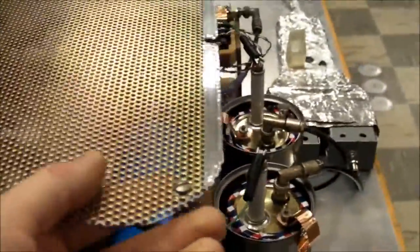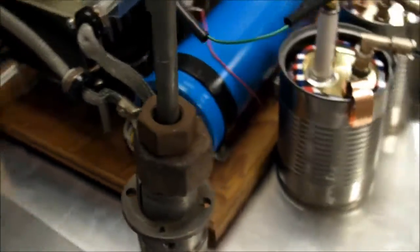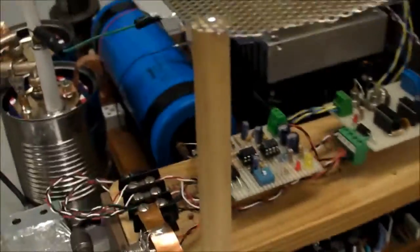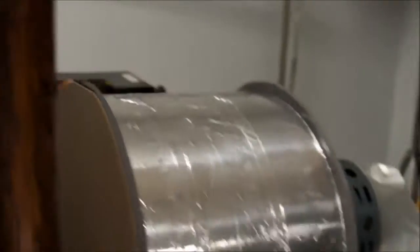I've got copper strips for extra grounding to my current transformers and the top shield. I replaced one of the wooden legs with an aluminum leg, and there are steel masses to weigh it down and make good contact. The probe itself and the cans are just resting on the aluminum plate as ground, with lots of other copper strips going down to the aluminum plates for very adequate grounding. On the spark gap too, I put some aluminum tape on the outside for some rounded shielding.